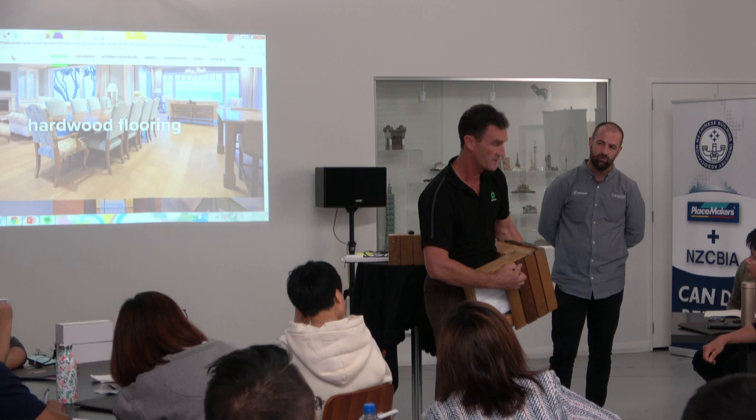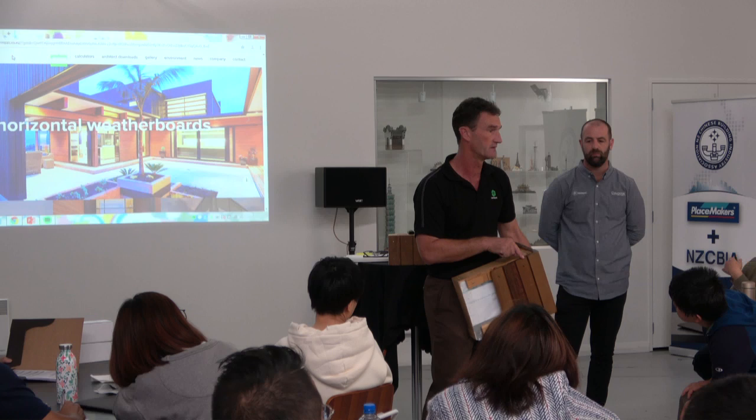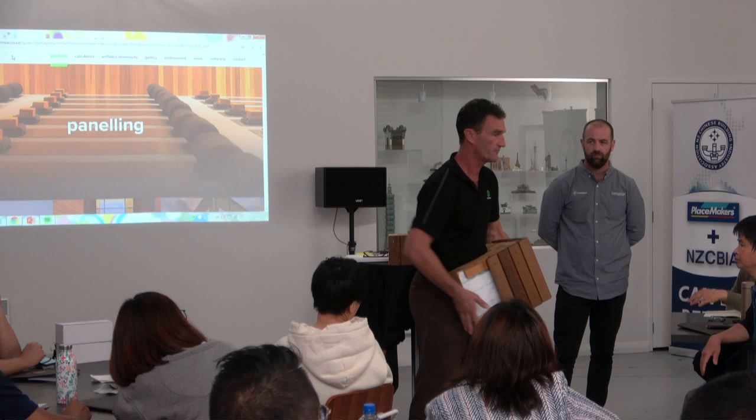This one here is what I would call a flat grain board, and this one here is what I would call a vertical grain board. If I was to coat this wall in black, I would expect to see movement on this board and not on this one. So that's the flat grain and the vertical grain. And the reason for that is, the flat grain board, the grain is sitting like this. And if it heats up, and it will heat up with the black, it can kind of fold up on itself. And what happens is when that's up on the wall, it folds out and back, and the sun goes across and then disappears. And out and back and out and back, and then over time it stays out. And that's what cupping is.